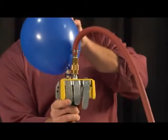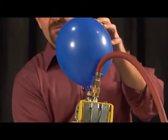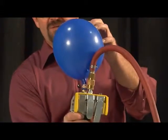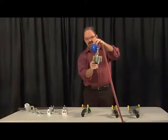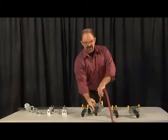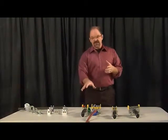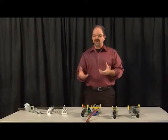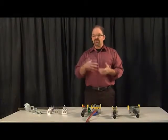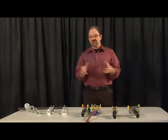It'll wait until you give it the exhaust command by pressing this lever, and at that point it will start to exhaust. You have the same good, consistent control and flow of that lever with the exhaust function, okay? The reason we have good, very even depression force and good control is that although these handles might look similar to other handles you might see out in the field, Gorbel designed these handles to be drop-in replacements with a significant improvement: we use a spool valve instead of the poppet valve that most competitors use.